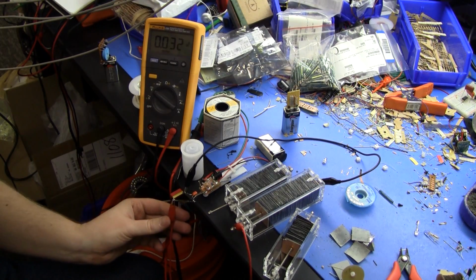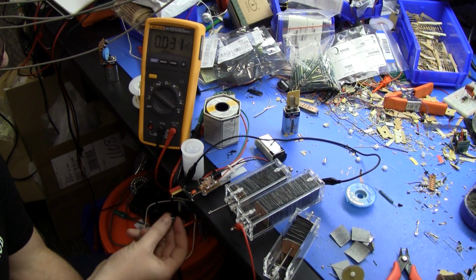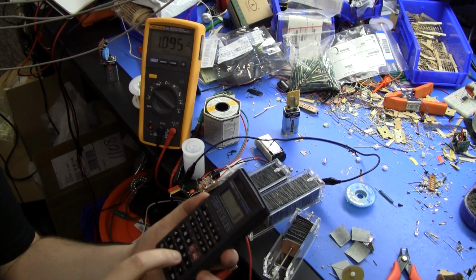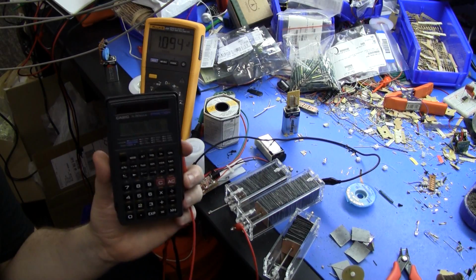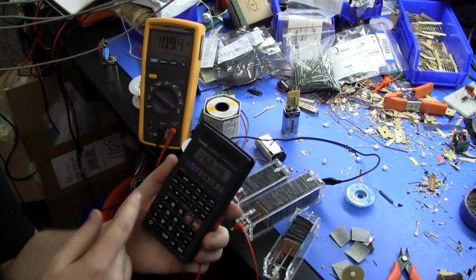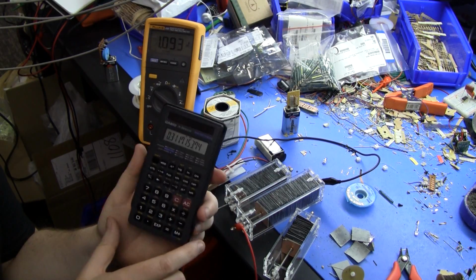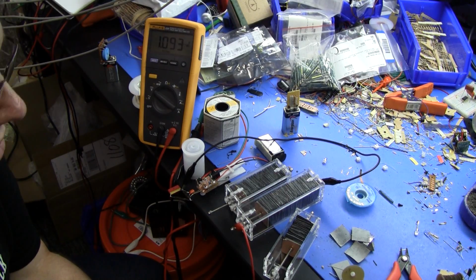Anyway, so this thing's been sitting there, you can see it's leaked 32 millivolts. Wow, that's horrible. Okay, so let's do the charge transfer. Oh, I touched it. Well, that's terrible. So that's 1.095. About 124 volts. That sounds more reasonable. So we know that there was 400-ish plates in there. I might have miscounted one or two. So that's 310, 312 millivolts per plate, which is reasonable, for an aluminium manganese dioxide cell that's been sitting here for a long time.